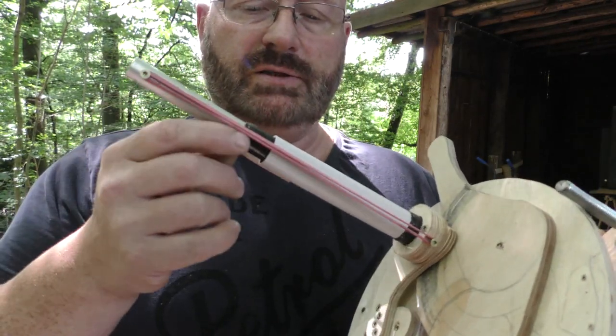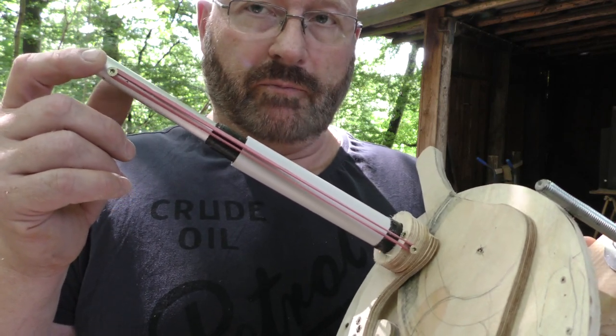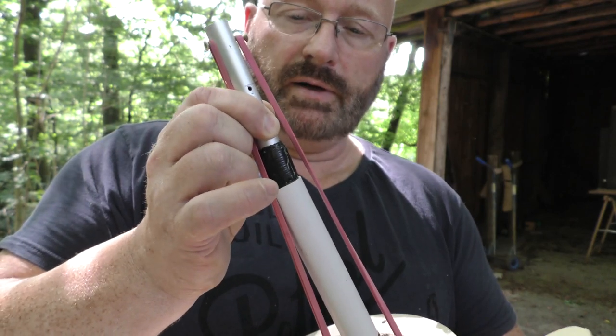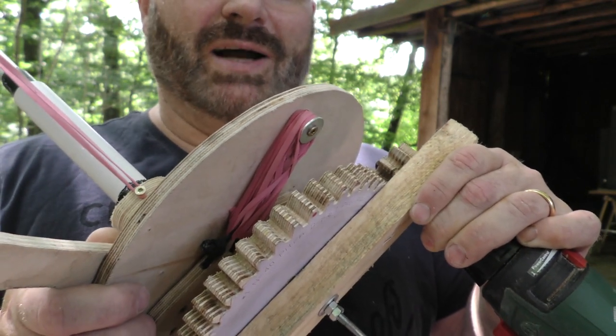The biggest change is that I am now force-feeding the ammo down the magazine tube, and this means that the fire rate can go up very much and also the reliability of the weapon goes up. This is done simply by a little tube that is pulled down by rubber. I also increased the amount of rubber — basically I doubled it.